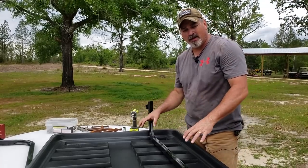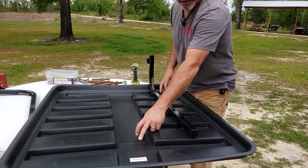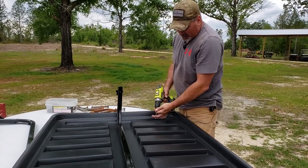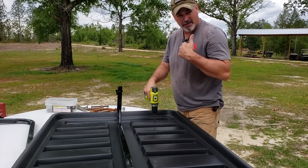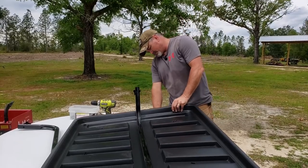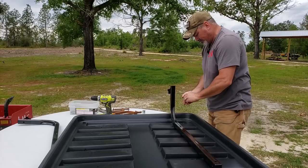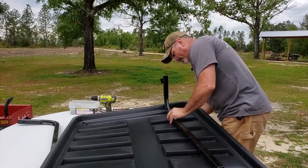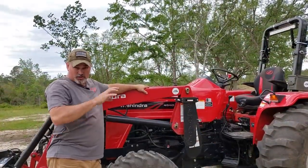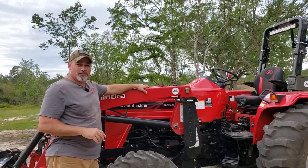I've positioned the struts on the bottom side of the canopy. You want the logo facing forward and down — so the Rhino Hide Canopies logo is on the underside of the canopy facing toward the front of the tractor. I've taken the struts off and made my marks to drill the holes, positioning it centered left and right and front and back the way I want it on the tractor. Now all I have to do is put the bolts through the brackets underneath the canopy using a big flat washer — this is a 7/16ths. I've got the brackets secured onto the struts onto the canopy. Now on the easy on easy off model I just carry it up onto the tractor, set it over the struts, and tighten it down.